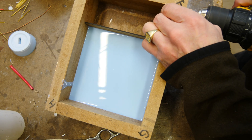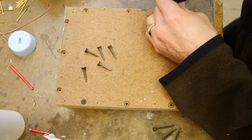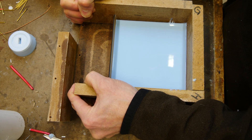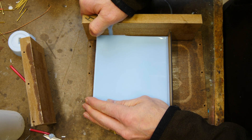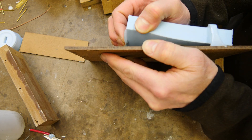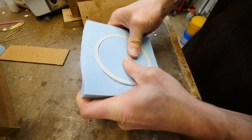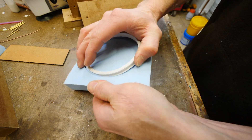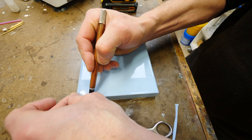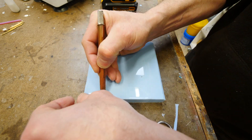The silicone is cured — probably about 12 hours later, the next day. I remove the screws out of the mold box and we can remove the silicone and the mold from its tomb. Let's pry off the sides, then the separator dam part, and we can remove the 3D printed part from the mold itself. Work it out nice and gentle — it does have an undercut, so be careful not to tear the silicone. I cut the edges of the silicone because this side is going to face down and we want it to be flat on the table when we cast a part.